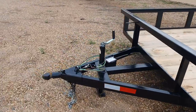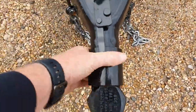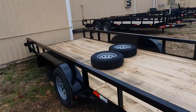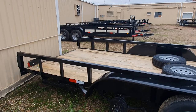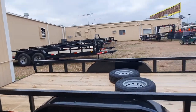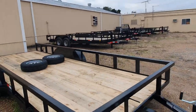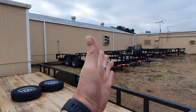Everything else is just about the same, but your hitch up here in the front is a little different. Still got your 7-way plug on here and the brake. It's 82 by 20 foot. We usually use this up to the 1,600 series or the 2,600 series. When you get the 2,655 or the 4,500 series, that's when we usually go with the heavier-duty trailers. I'm estimating you can put a total of maybe 6,300 to 6,500 pounds on the lighter-duty trailer.